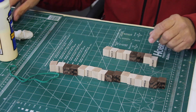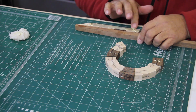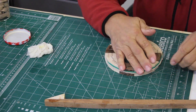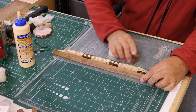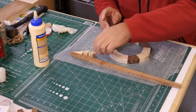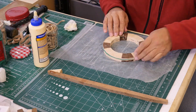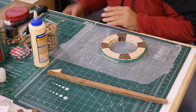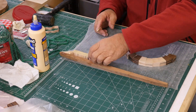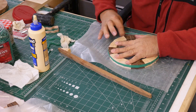I've tried different methods for gluing up the rings. I used to use band clamps but found they twisted them into a slight oval shape, so I started using rubber bands. I bought a bunch of different sized rubber bands and find they give equal pressure all the way around. For smaller rings I just lay them out, apply glue, put them together, and wrap the rubber band around. Once the ring gets bigger than my hand — where I can't hold the entire ring while stretching the rubber band — I employ a different method.